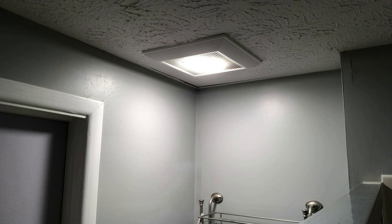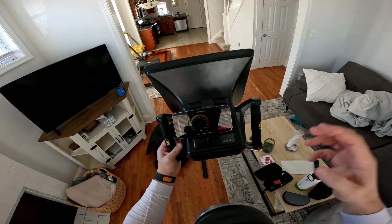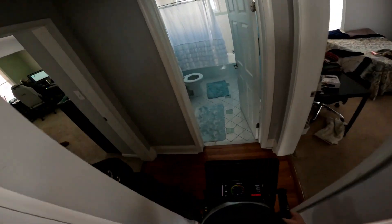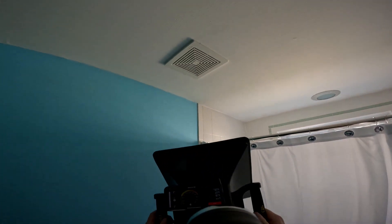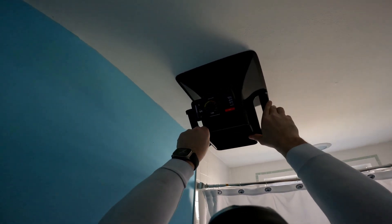The audit gear is definitely going to be the lion's share of the cost to get into this, but it's well worth it. The first thing I want to talk about is measuring airflow — the most important being exhaust fan airflow, though you may also need to measure airflow on returns or supply ducts for the HVAC system. I recommend a product made by a company called CPS called the AMB Easy Hood. It has a little attachment that links to your phone via Bluetooth with an app, and once you get the hang of it, it works very nicely.